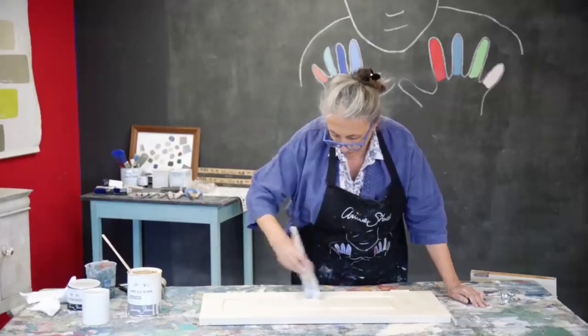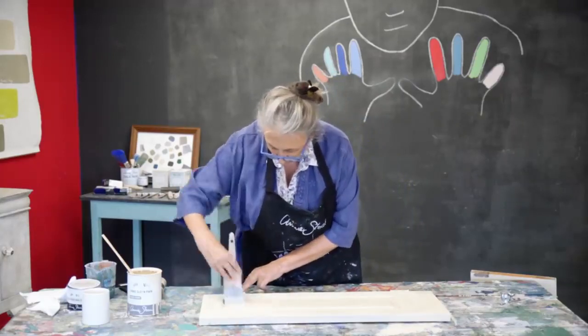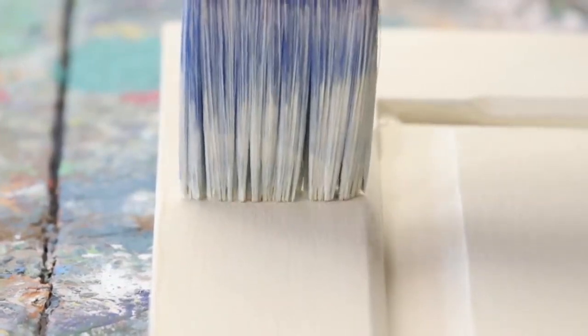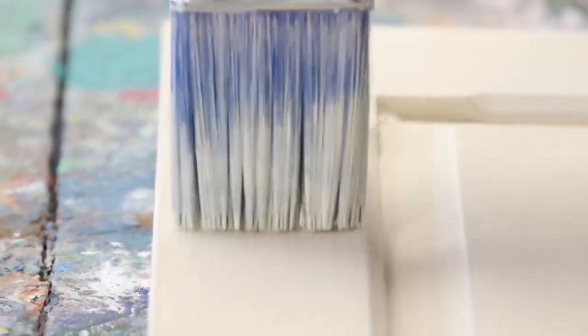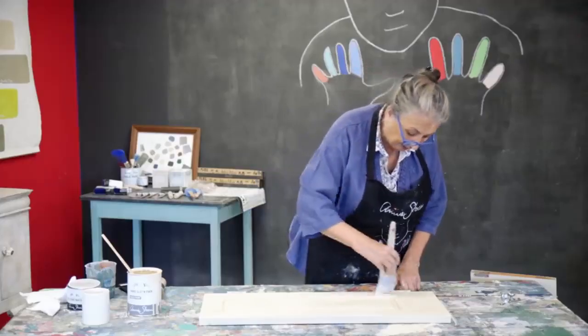It's absorbing quite a lot. Now I'm going to start feathering it. This is very pleasing to do because as you do it the surface becomes smoother and smoother as you feather out. The brush is just hitting the paint — it's not pressing down, it's just hitting like that and going across. It's really light and done with a very small amount of paint, usually done quickly.